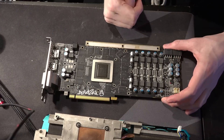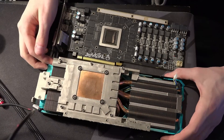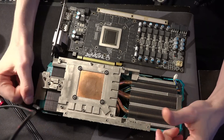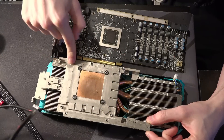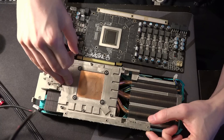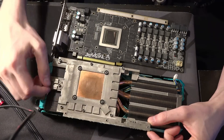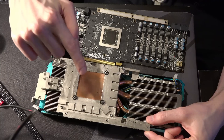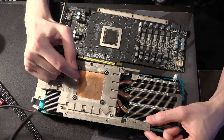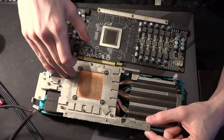When I finally got around to cleaning the card, I didn't have the right size thermal pads. This is one of my major issues with the VaporX heatsinks: because they sink all the VRAM into the same assembly as the actual GPU core, if your thermal pads are a little bit too thick, your core will not have contact to the heatsink, which is really annoying.